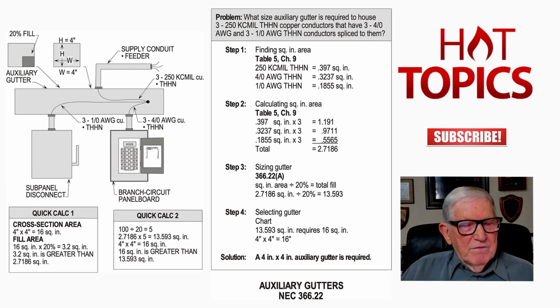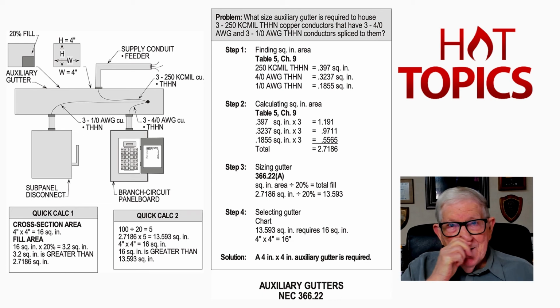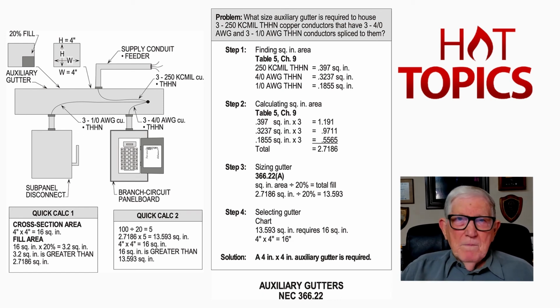pick up live parts. Now notice what it says. Power distribution blocks shall not have uninsulated live parts exposed within a wireway, whether or not the wireway is covered and installed with a cover, see. And then it tells you about the conductors. They have to be insulated. So you lose that benefit.